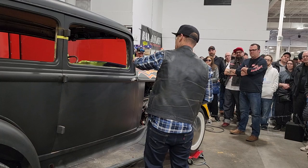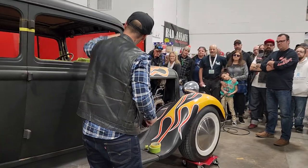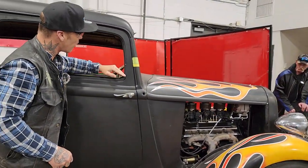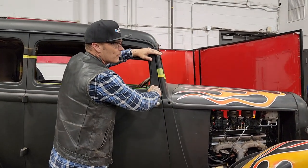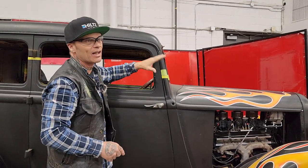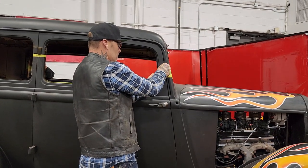So what I'm going to do is get rid of that. Like I said before, if I cut it here, that means I have to weld it back together there. With it leaning like that, I'd have to relief it somewhere, probably top and bottom, to make it come together. Instead of cutting it here and welding it back together, I might as well just cut the post out. I've got one weld mark down here, one down there. If I do that, then I've got three. So I'm going to checker it up a little bit and make two cuts instead of three.